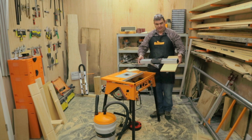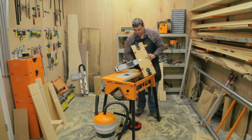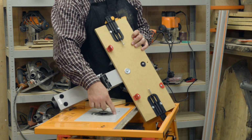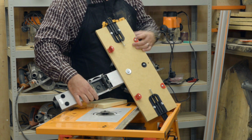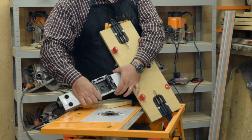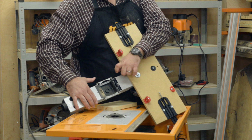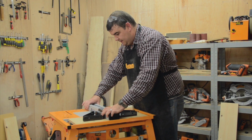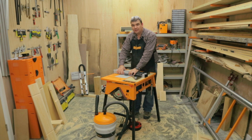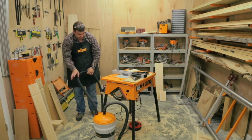And this is what the biscuit joiner looks like. You'll be interested to know and see how it works. Well, in the table over there, there's a little slot, and this little nipple over here fits directly into that slot. You cannot move the biscuit joiner, so it won't engage that pin unless that's depressed. See how that slides down? Okay, so otherwise it won't move. Press these over here, now it will move up. Okay, so it's just a safety so that you cannot accidentally expose the cutter. You can depress that and then the cutter will expose. Okay, just like that. Okay, let's hook up our dust collection.